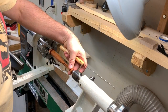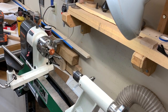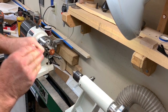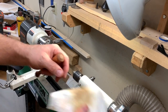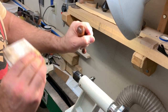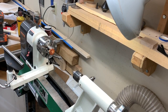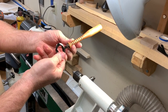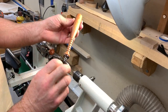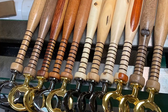Once you get that finish done to the desired amount, it's time to take it out of the lathe. You could part it off while it was spinning, but I always like to use this Japanese saw to cut it free — that way something doesn't go flying on me. When you do that, there's a little tiny nub that needs to be sanded at the top, so I grab a little bit of sandpaper and take it down. If it's real hardwood you may need to use a machine; this is pretty soft so it's easy to do by hand. Put a little bit of finish on there — when I get that finish on there it'll blend all nice and look good together. After we've got it all done, it's time to screw the bottle opener into the bottom. Mine has a nice tight fit, I do not think I need to put any glue on it. If yours has a little bit of a loose part, feel free to put some glue on those threads — that'll hold it in nice and tight. Well, that's it: your softball bat or baseball bat bottle opener. I made a whole bunch of them, one for everybody on the team. Thanks for watching — please like and subscribe.